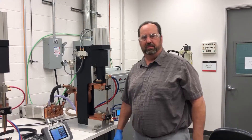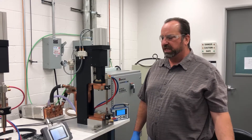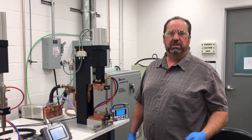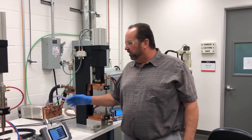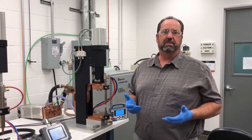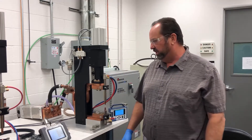Hello, my name is Loren McClellan. I'm with Amada Weld Tech. Today we're going to talk about the MM410 portable weld monitor, or weld checker. Weld checkers have been around for many years, typically used to measure current, voltage, power, resistance, and time. Recent technologies have allowed us to include force and displacement with the MM410, so we can associate the mechanical aspects of force and displacement with our electrical parameters — voltage and current.